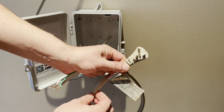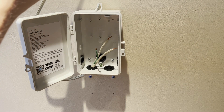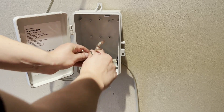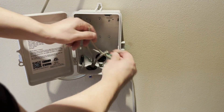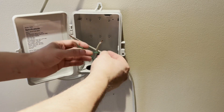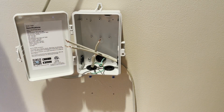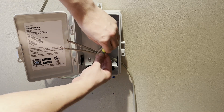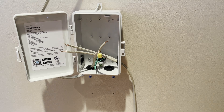Here is the cord — I just cut the cord in half. This is a 240 volt cord. It's not a lot of amperage; I think it's only like 12 or 13 amps at 240 volt, so it's not a killer amp draw, which is a good thing. Now, the ground — I'm not going to put the ground onto the box because I don't have this going into steel or a stud, so that ground is really doing nothing since it's grounded to the plastic box. I'm just going to wire nut these together. The only ground is on the box; there's no ground specifically on that controller. If you have a power surge, it may break — I've seen power surges bust stuff up, so it depends on your area.